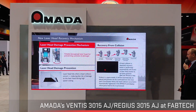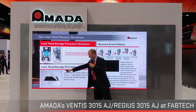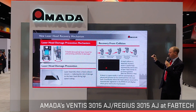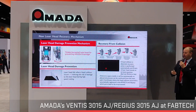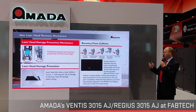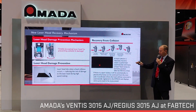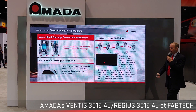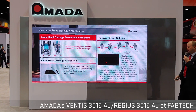The collision recovery system addresses situations where a micro joint or tab didn't hold, causing a part to tip up and a head collision. The machine retracts the Z-axis to free itself from the collision, remembers the coordinate where it occurred, returns to replace the nozzle, uses the ion nozzle checker to center it, then skips to the next piece of geometry and resumes cutting. This is invaluable in automated environments where one part tip-up could otherwise shut down an entire unmanned shift.